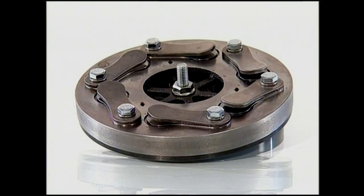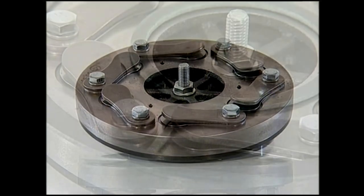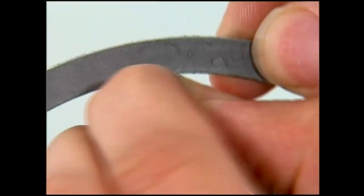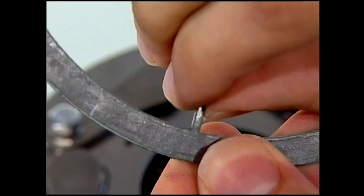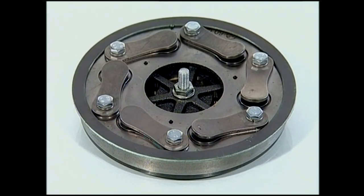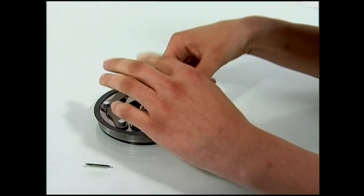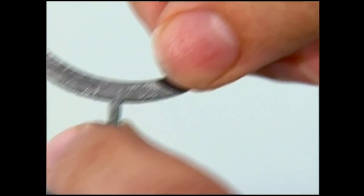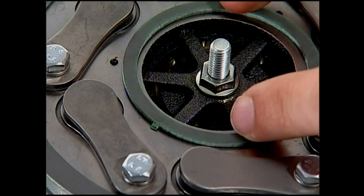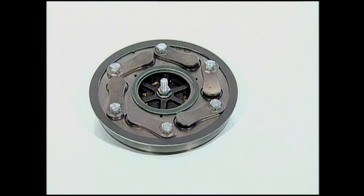The second stage lamellar valve will be treated similarly. Remove the bridging elements between the inner and outer rings on the second stage cylinder head gasket. Lay the outer ring around the lamellas. The inner ring has to be positioned between the pins. This smaller gasket is critical for the separation of the suction and delivery side.